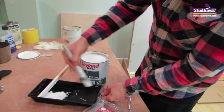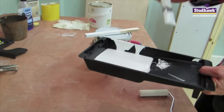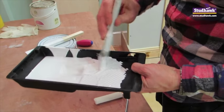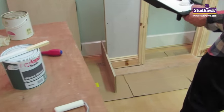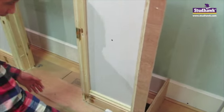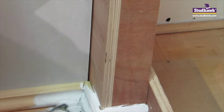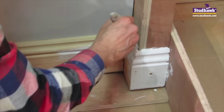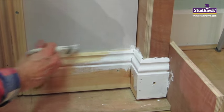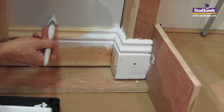An important thing about painting and how you use a brush: you cut in on edge, then flatten out with the flat. So let's paint some woodwork — these are oil-based paints, this is the primer. We'll start loading where the roller is going to pick up its paint. Start at one end and work your way around — don't start here, go there and come back. Do it methodically. I always do the woodwork first, so that it doesn't get splashed up with emulsion. Then we tape across the top of the woodwork and up the side of the architraves, putting the four-inch roller straight down to the tape for a beautiful roller finish — not part brush and part roller finish, which really looks naff.